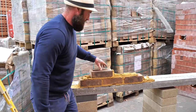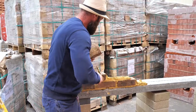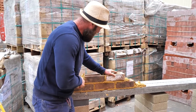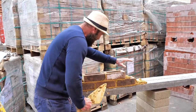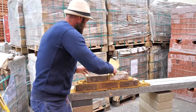Look at that. Excellent. So now we're going to get the next brick. Squeeze against brick one. Hold the brick one tight if you have to. There, look at that. Look at the thumb working, look at the thumb working. In, look at the way I'm looking down the wall. I'm maintaining that level, I'm maintaining the plumb.